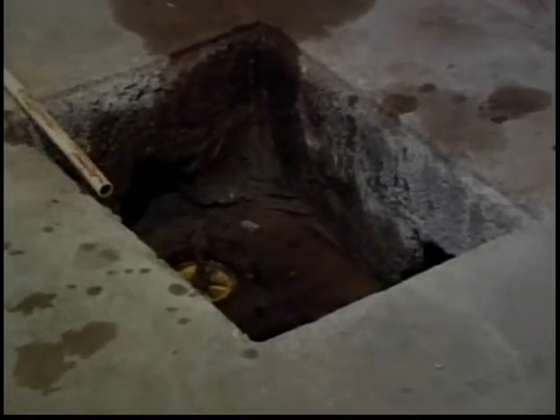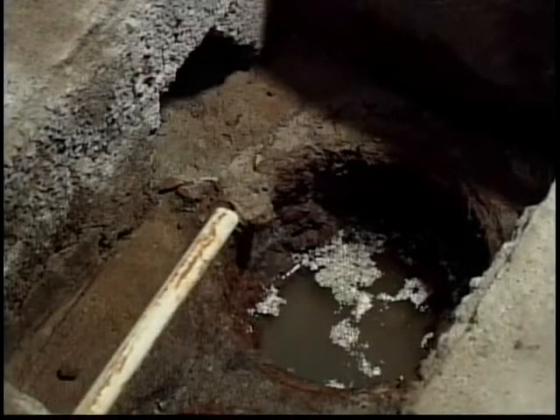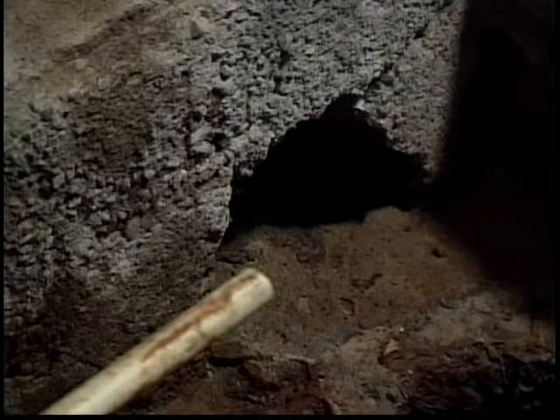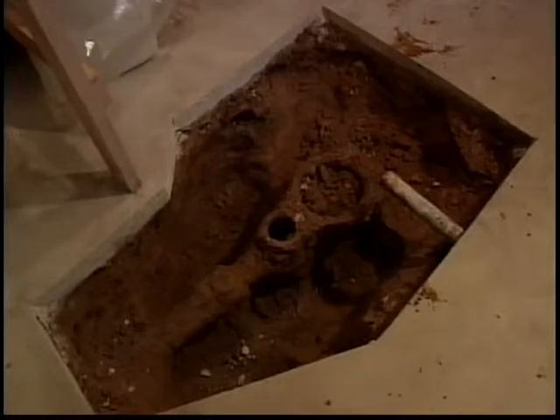This is a typical recessed floor drain that has three tiles. The tiles are typically orange in color but may be black plastic. Here with the concrete removed in this shot, you can see the wash machine drain line and the old cast iron floor drain and clean out. This will be replaced with new PVC.